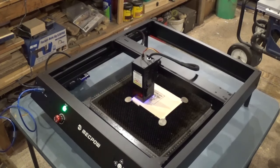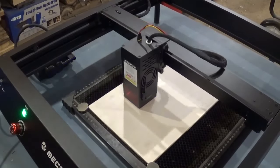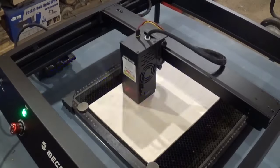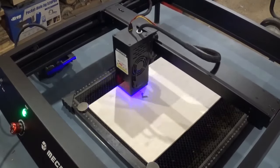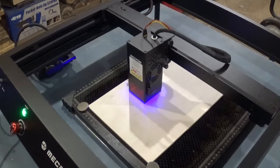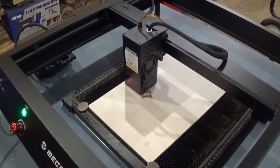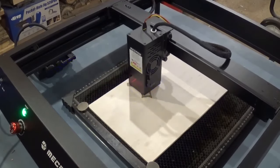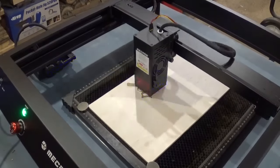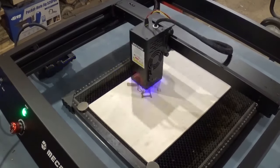After the test file was done and I was happy with the settings, I was ready for my very first project — a cell phone stand made out of the same quarter-inch material. It's engraving my Artisan Pirate logo onto the back of the phone stand and takes around 15 minutes to make. These are totally customizable — you can put any quote, photo, or business logo on the back where the cell phone rests. After engraving, it proceeds to laser cutting, and one thing I love about this laser is it has automatic air assist that kicks on during the cutting process.